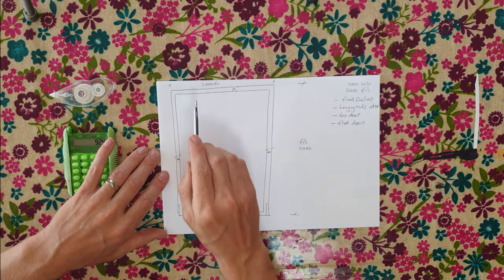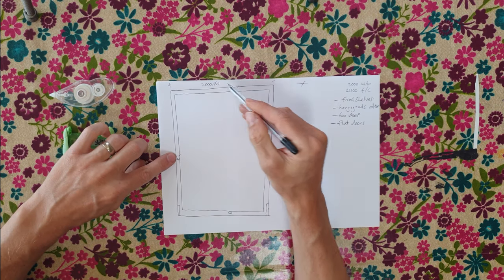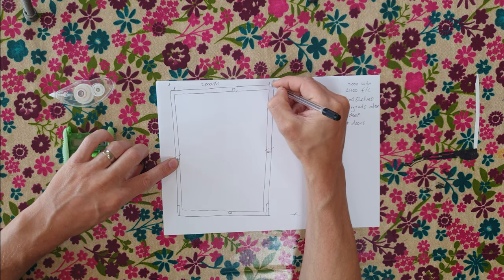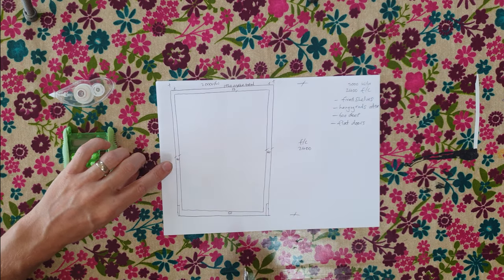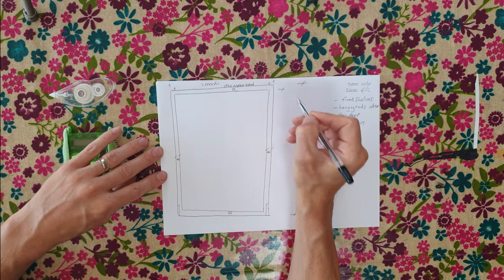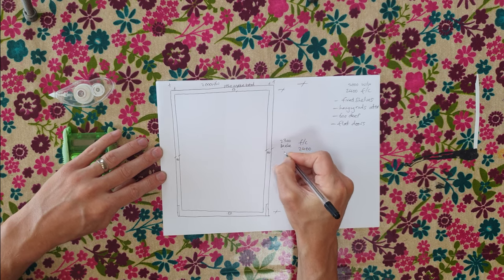All right, so now we've got our overall site size, wall to wall, 2 meters. We could then go, okay, what's our overall carcass size? We go 2 meters minus 40 and 40, which is 1920 make total. Okay, and then we've got the make height of the carcass, which is there to there. It's 2.4 minus 50 and 50, is 2,300 make height.